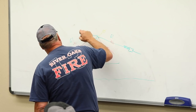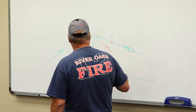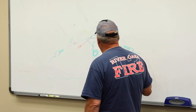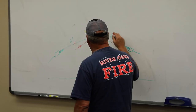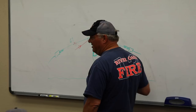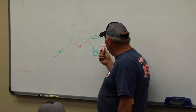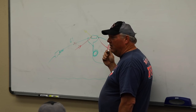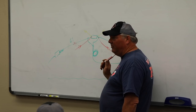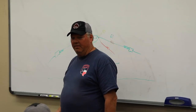So you put this coil right here, and you get them as close as you can to balance. Then you can still trim it up a little bit. And that shortened antenna, you can take this down to 51 feet, 45 feet. Is it as efficient as a full-sized antenna? No. But if you're running a couple hundred watts and talking to your friend in Nevada, and the band's open anyways, can he hear the difference between you and the guy that has a full-sized one? No. That's why they make them like that for mobile antennas.